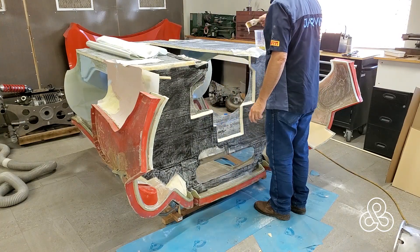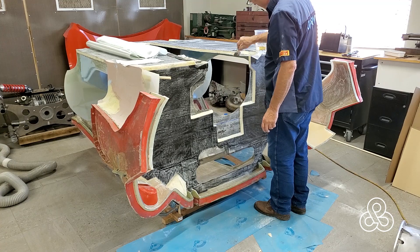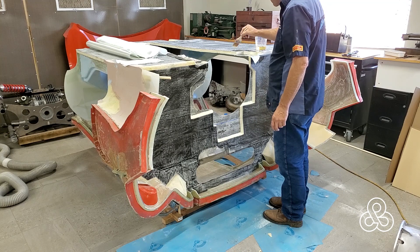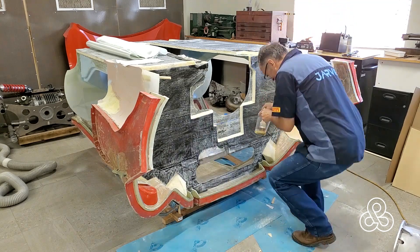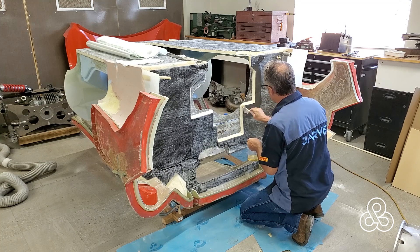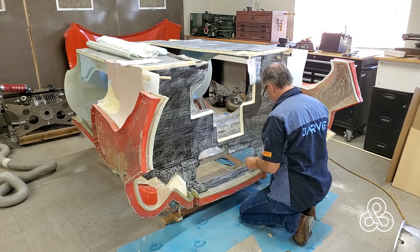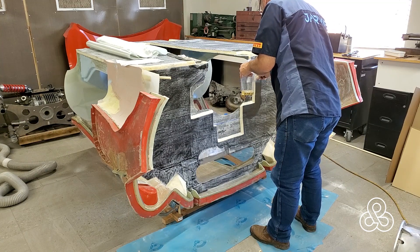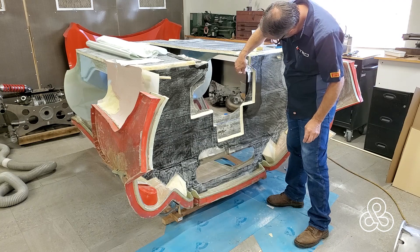Here I'm going ahead and starting to add some layers of nine-ounce twill fabric. The twills are much better at conforming to compound surfaces, especially at 90-degree bends. So we're going to use this nine-ounce twill to go around all these edges of this foam. This foam has a layer of fiberglass on each side, but once that fiberglass was on, I trimmed it and put a 45-degree bevel in the foam. So we have that 45-degree beveled edge with exposed foam, and this is a foundation layer to seal that up and give us a nice surface area.